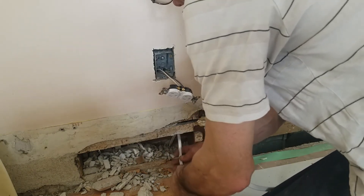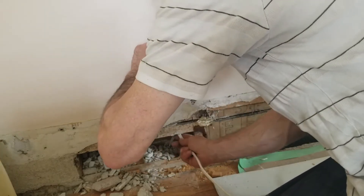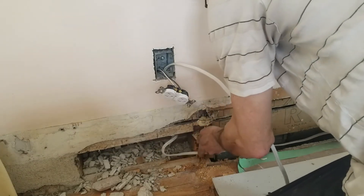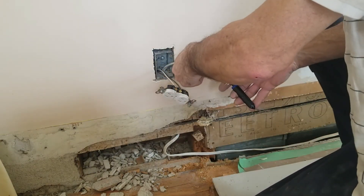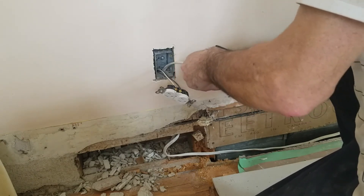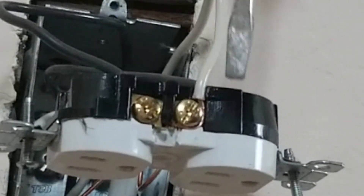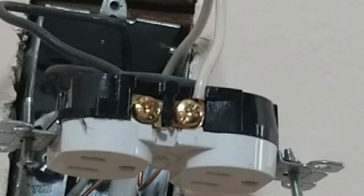I'm going to feed this wire up here — hopefully I've got a clear path to bring it right through. I've zoomed in on the outlet to show you how our wiring is going to work. The wire that we're running to the switch will be used as an interrupting wire. It's going to take the power coming out of this hot terminal to the switch and returning back through the black to energize the top receptacle. I'll get this back inside the box and we'll wire up the switch.